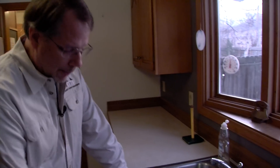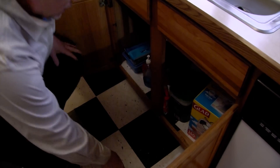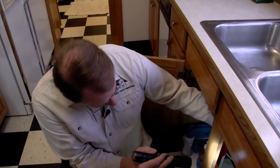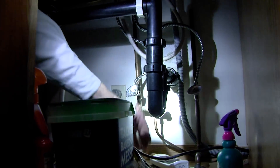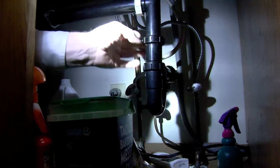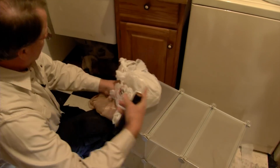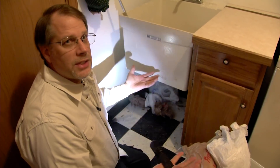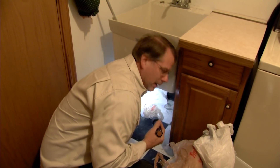On the sinks, you're not seeing any water on the floor so you think everything's good, but go underneath the sink and look at the fittings on the water lines themselves. These lines can kink — this one even has a little bit of a kink in it. You're gonna want to check if the lines are loose; this one is already loose and you'll want to re-secure it. Most of the time people store stuff under the sink and it's not obvious until you go down there and check it.